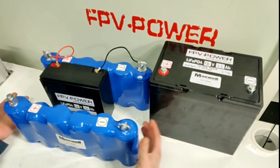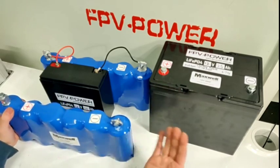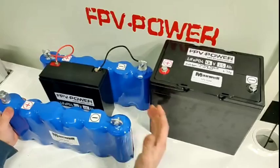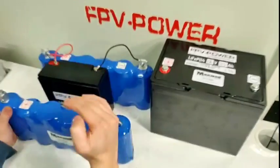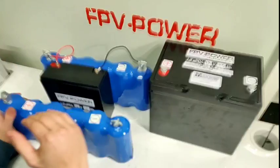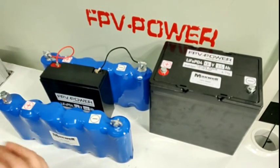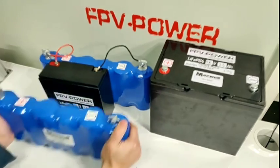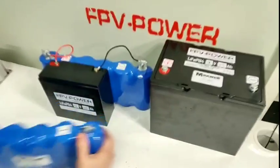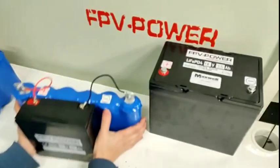when the bass drops with a high powered amplifier with the car engine running from about 14.4 volts, when the bass booms, they call it burping, it would drop down, hits hard, 12.2, 12.3, 12.4, and the voltage drops from 14.2 down to 12 point something. That's a lot of voltage, a lot of wattage loss. Install a super cap, it drops 0.3, 0.4 volts, minimum drop. So move that aside, that's a single super capacitor, $150.